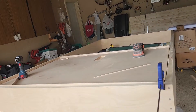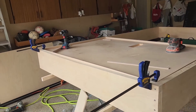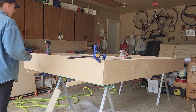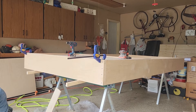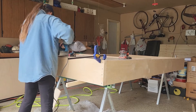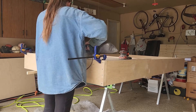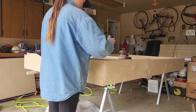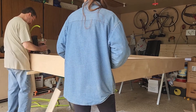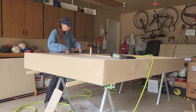Back up in the garage with the plywood gluing, we wanted to add a little support underneath the piece of plywood on the bottom of the frame. Earlier we had put a strip of wood around the inside of the beam supports — one piece of plywood sat on top of that and one on the bottom — and for a little extra added support we added another strip of wood around all four sides. Because we added that piece of wood, it needed to match the curvature of the curved front cross beam, so we did a little sanding to get everything flush.